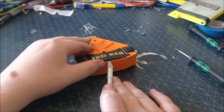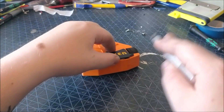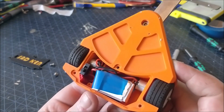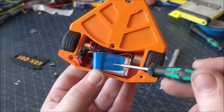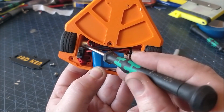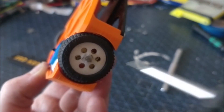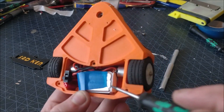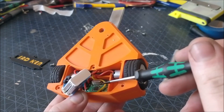Through the medium of gentle stabbing, the lid is removed and you'll be able to see that internally it's fairly sparse and standard. There is a 180mAh LiPo, two cells, powering two N20 gear motors which drive Lego tyres and printed hubs. Located next to the battery is a charge point and on switch, and hidden underneath is another Malenki Nano.